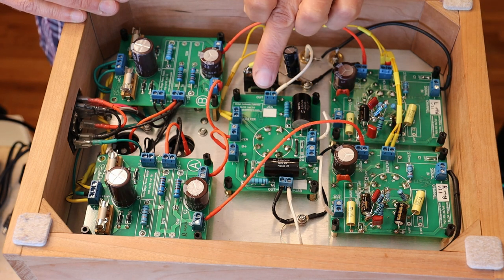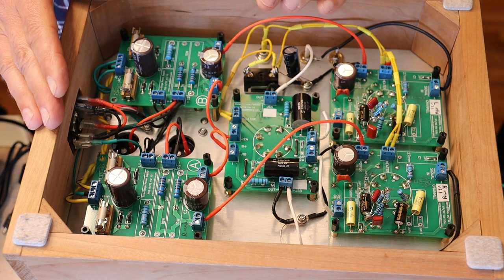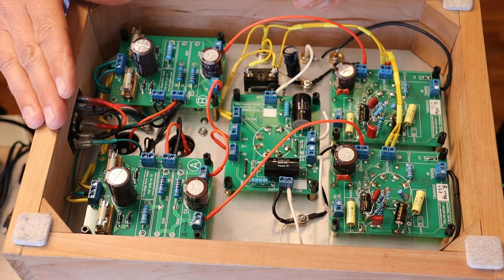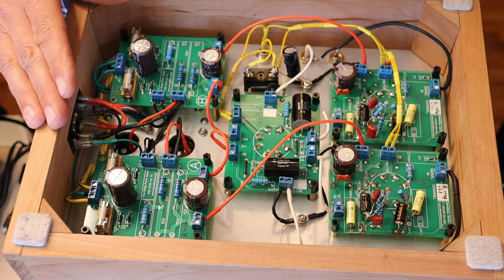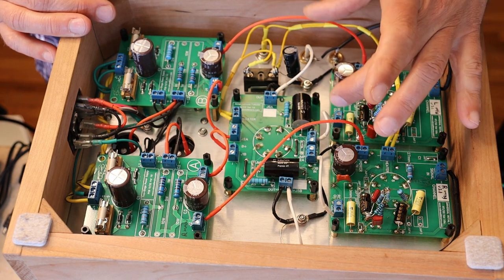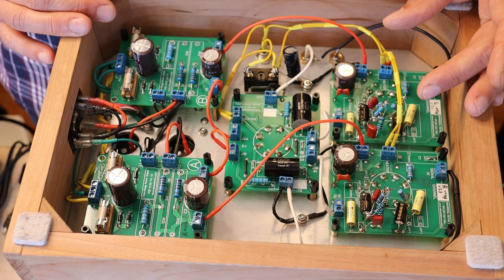And now it goes into a cathode follower. And the reason why we like to use a cathode follower, typically people call this a CF stage, call it a cathode follower stage, that's fine, is that we're coming off of the voltage gain stage with very high impedance.